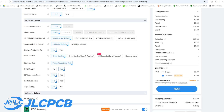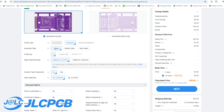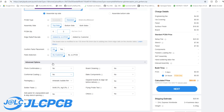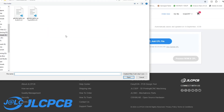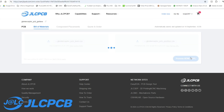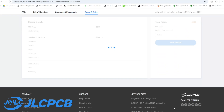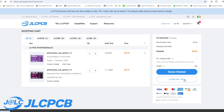There are different colours — standard green, blue, and yellow. Just check the pricing as you go because sometimes a different colour means a longer lead time; yellow was going to take longer for some reason. I went with purple because it was the same price and just as quick. For PCB assembly, we're getting five boards but only two assembled — one for myself and one for Jimbo. Once all that's done, click next for a brief overview of how the board will look, then upload the bill of materials and position file — all found on Stax's GitHub. You'll get a cool 3D model showing roughly where everything will be placed, and then a final price and build summary.